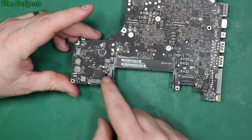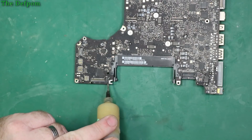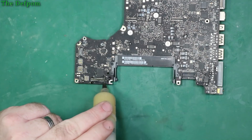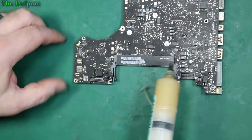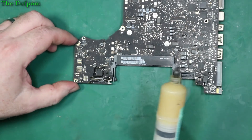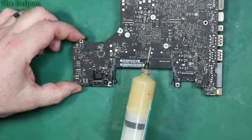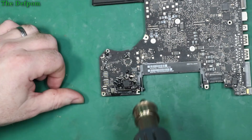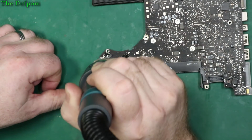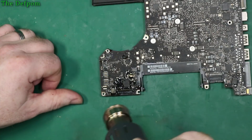So that's obviously in this area of the board here which has all this corrosion. When it comes to trying to clean this bit up, this is going to be interesting because of these connectors which are obviously going to be a bit corroded too. And this chip here — I'm not going to lift it off, I'm just going to flux it inside this connector here. I'm not really going to try and heat these up too much, it's going to be gentle. Got to be careful not to heat these connectors up too much — don't destroy them.